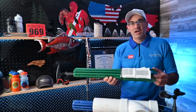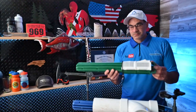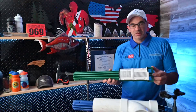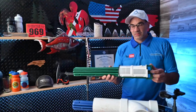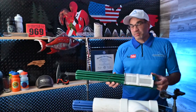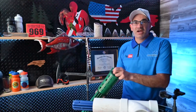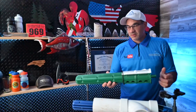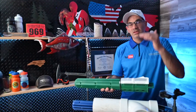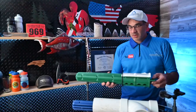The next time you get your septic tank pumped out — which should be every three to five years — when the pump guy has the hole open, have a septic installer come in and install a riser for you. That way you can pop the top, access this filter, and greatly prolong the life of your tank and field. Also, you'll see videos where people pull these filters out and just spray them down inside the tank — you would never want to do that. One of the main functions of a septic tank is to stagnate the water so solids fall out and scum floats to the top. You would not want to agitate that system by spraying a garden hose in it, unless you're pumping it.